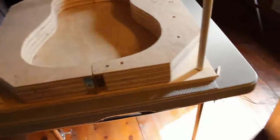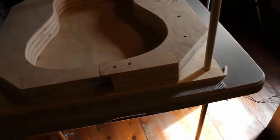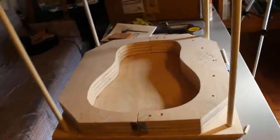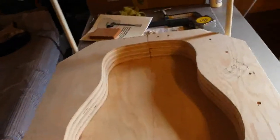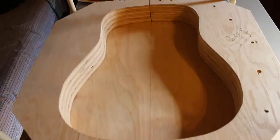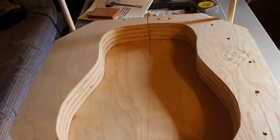As you can tell, I've mitered the corners 45 degrees so that it fits on my Go bar table jig that I made up. Then I marked the center line, so that I can put the sides in there and trim the ends off of the pre-bent sides from Martin.